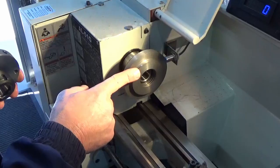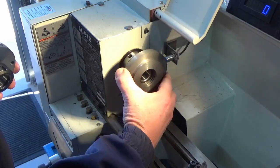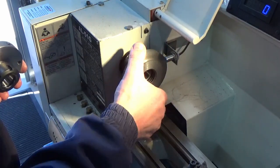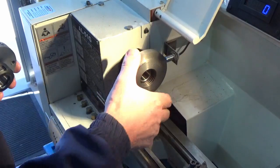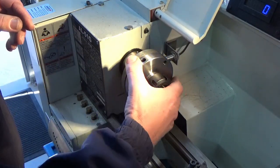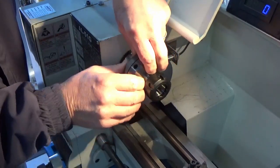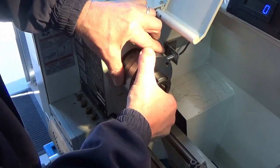We've actually brought this in and started cutting back on the depth of cut to 0.05mm until we just got it. As you can see we've cut right around — part of the old register was a bit out of alignment — but we've still got four millimetres of new register behind it, so we're not too worried about that. If you put that on to the right fit now, it is a very firm fit but can still move around just slightly.